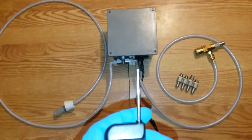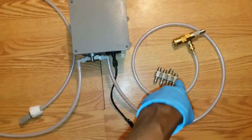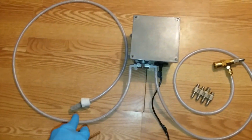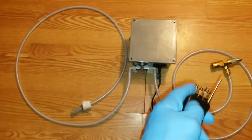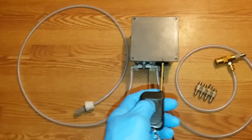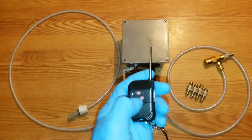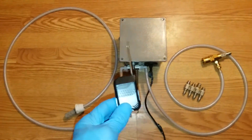Screw it down, hook this to either your pressure washer or your hose reel. Put your J-rod or your soap tip in your nozzle, drop your soap siphon tube into your soap bottle, turn it on, turn your pressure washer on. When you turn your pressure washer on, hit your on button if you want your soap right there, and when you're done with your soap, hit your off button. Just that simple.